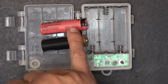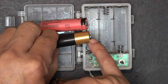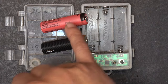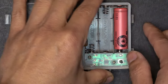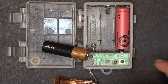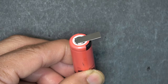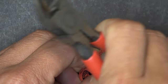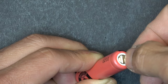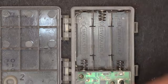The first thing is to modify the lithium-ion battery because it has a flat top, unlike the alkaline battery which has a nipple sticking out about one millimeter. That nipple lets the battery reach and touch the terminal in the battery case. Since the lithium-ion battery has a flat top, there's a gap and no connection is made. I spot-welded a nickel strip right on the battery terminal, folded it one way, then the other way, then again — now I have a nipple sticking out about two millimeters.